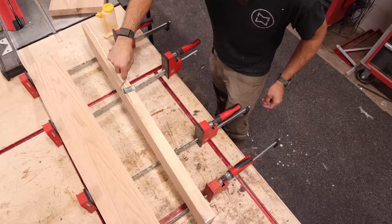This piece is still super rough — I'm gonna run it through the planer but I want to make sure I don't have any side-to-side rocking, so I'm just taking off the high spots. We need to mortise the leg into the bottom of the table — I drew some lines on the top and picked a location. I'm gonna build a quick little router jig that I can use with a templating bit to get the perfect-sized mortise for this leg. I'll set up the router to cut a half-inch deep mortise, and then we're off to the races.